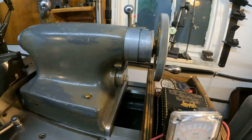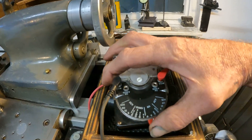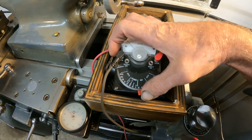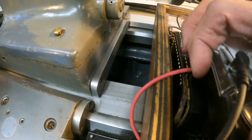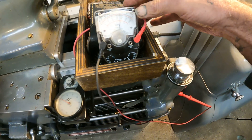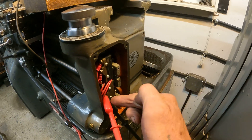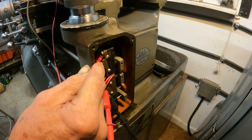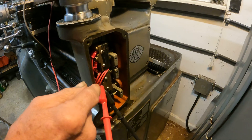I'm going to get this antique voltmeter and put it in times-one ohms scale — kind of stiff. Okay, got it — times one at ohms. I've gone across one switch here; that's the reverse switch because it's easy to get the alligator clips on the two poles. That's the forward switch. So I just put the clips on there.